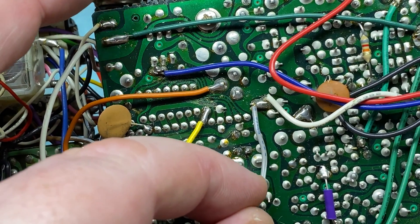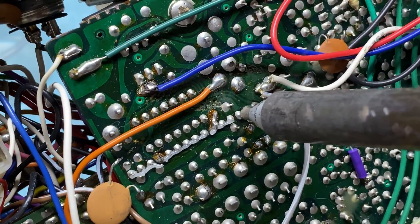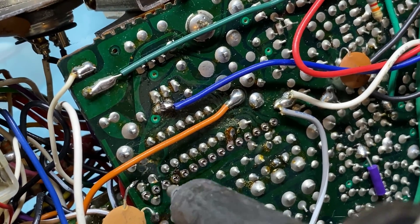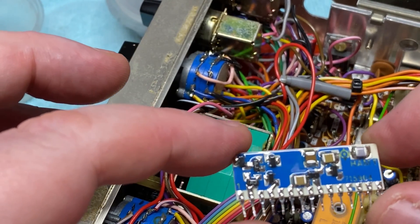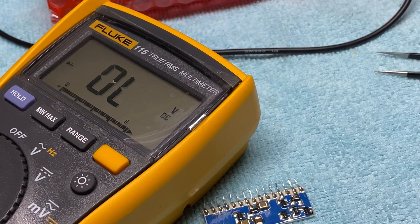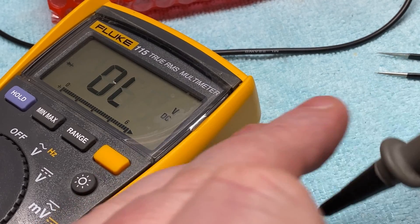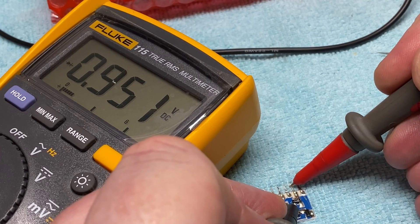Let's have a look at the bleep module. That's the thick film unit there — I've been advised it could be one of the transistors on the thick film holding the TX line on. We put a little bit of flux on it to liven up the old solder and make desoldering easy, and get the thick film unit out. I'm measuring the suspect part and it is measuring leaky across one of the junctions — so have we found the issue?